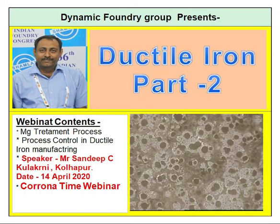If you do it like that, and your inoculation quality is good, then definitely you will have good nodularity, good machinability, a good nodule count, and you will get good metal quality. Ladle design, as I told you, should be a 2:1 or 3:1 ratio. I will not go into detail because it is a constant factor.